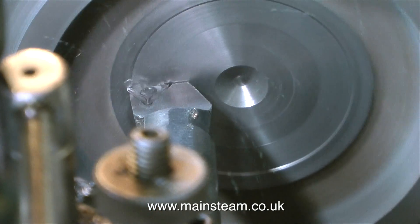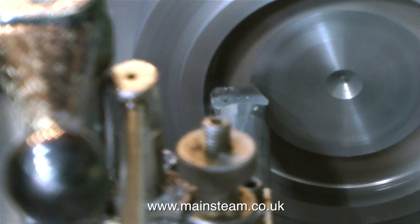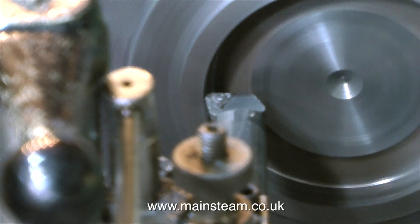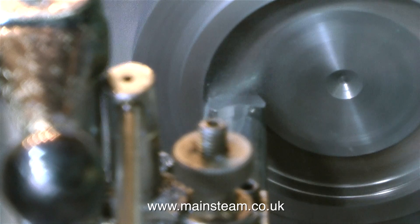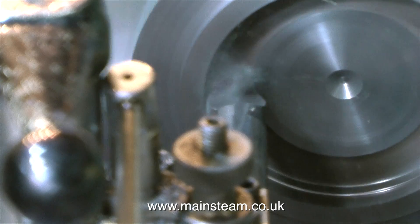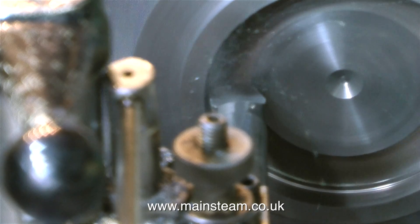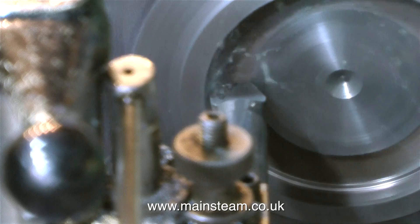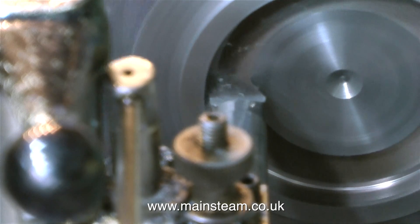I can't use the boring tool anymore without drilling another hole, and I don't want to — this would solve the problem only temporarily. I'll change to my modified parting tool from a previous video. The boring tool has been great for rough cutting; had I used the parting tool for this I would probably have broken it. It has one more job: machining the inside edge of the register.